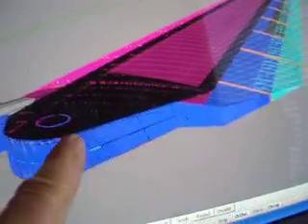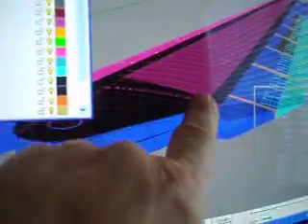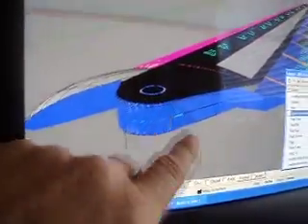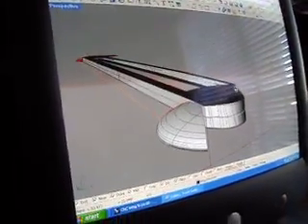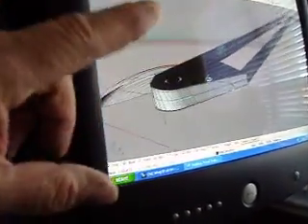There is the wing — you can see the full outline, and the part we're cutting now is just this inside part, the black and red in the center. That'll all be carbon fiber. Up here by where the bearing goes we're going to carbon fiber that up, then taper the carbon fiber down as we go out, and laminate our skins to this piece. When you get into composite wings, what you really got to worry about is the wing collapsing. If you can keep all that composite stuff from collapsing and make it real rigid, you can drive a car on it.